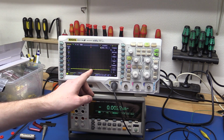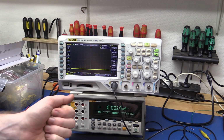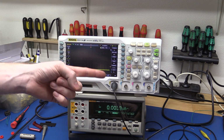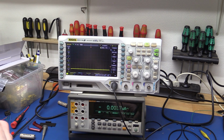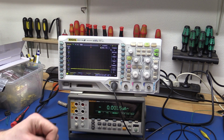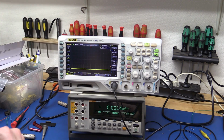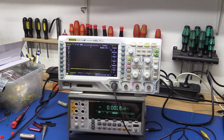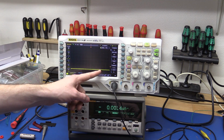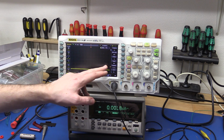So interestingly enough, it's still pulse frequency modulation. Maybe that other battery was just right on the edge of where it wanted to regulate, or just pass it straight through. It did look like it was going into pulse width modulation though, but apparently not. Let's just try that again. And here back with the higher impedance load, and you can see it's still pulse frequency.